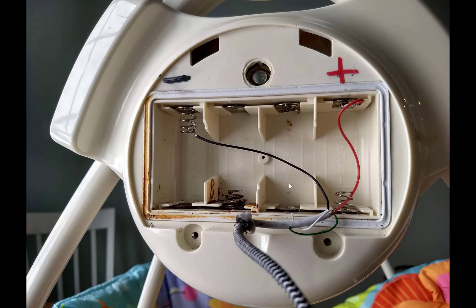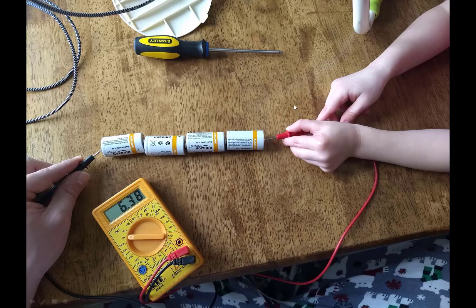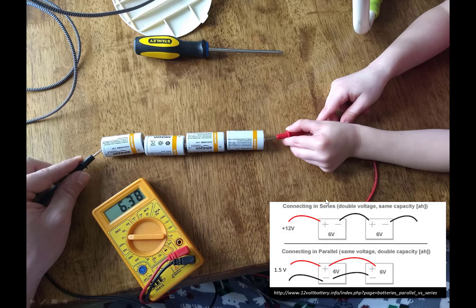Let's get into the basic information you'll need to know. If you go back and forth on these two images, you'll see there's a metal strip adjacent to the negative terminal of the battery, and it comes down and becomes a component of the negative terminal of that battery. This allows all of the batteries to effectively be in a line — in series. When you put batteries in series, you get double the voltage but the same capacity, whereas parallel gives the same voltage and double the capacity. In our case, that means 1.5-volt batteries in series give us essentially 6 volts.